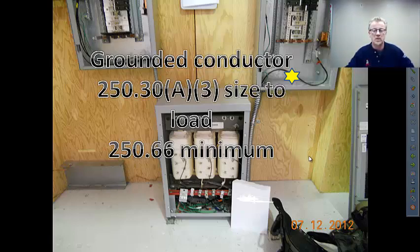In Video Two, we were at the tail end of specifying our secondary conductors and secondary grounding. For 250.30, you really just need to read through 250.30. If you have a grounded system, read through 250.30A — it spells out step by step all the grounding you have to do. We've talked about the grounded conductor, the neutral, the system grounded conductor.